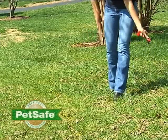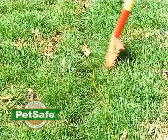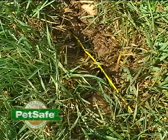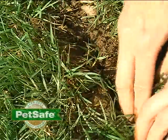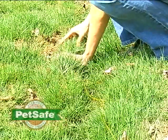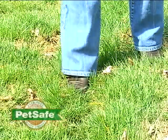To make installation easier, you may want to wait until your lawn is moist. For small lawn installations, use a sharp garden spade or a gas-powered lawn edger — you only need to split the sod going down just 2 to 3 inches. It will also help to cut the lawn at a 45-degree angle. Slip the wire in with your fingers or push with a flat wooden paint stick. Have a friend follow behind tapping down the earth by walking the line, and be sure to avoid pulling the wire too tight as it needs to expand and contract with temperature changes.